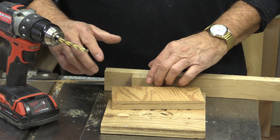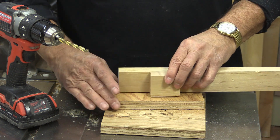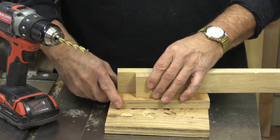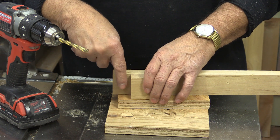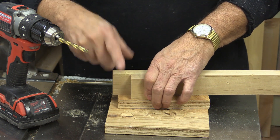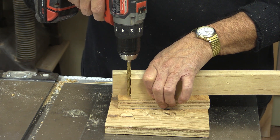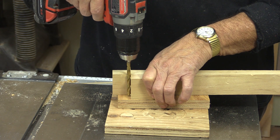Not everyone has a drill press, and sometimes you still need to drill straight vertical holes. I used this method for years before I got a drill press — just get a couple of pieces of scrap wood together. It's nice to drill at least a starter hole, but basically all you do is line up your drill bit and you can get a very good hole. That concludes my video for today. I hope there are some ideas that will help you next time you're using your drill press, portable drill, or cordless drill to make more precision holes. I'm Colin Kinnett for Woodworkweb — thanks for watching.